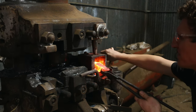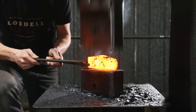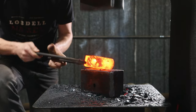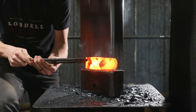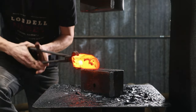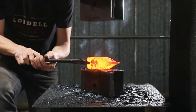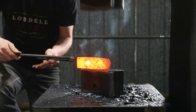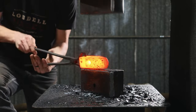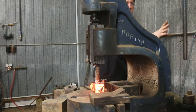You can tell by my verbal communication, I really got that eye perfectly centered on the hammer. It really is the best way to start the day, by getting everything perfect. Once I come out of the Upsetter, I have to deal with something called suck-down — that's kind of where when the punch makes the hole or the eye of the hammer, the material rolls in. It's not a desirable thing.